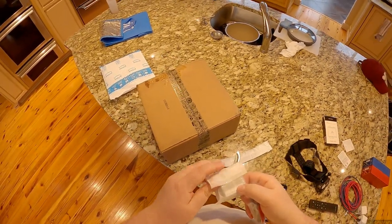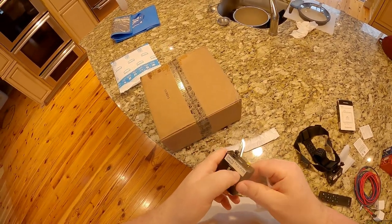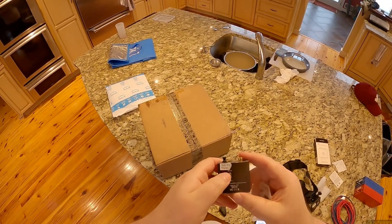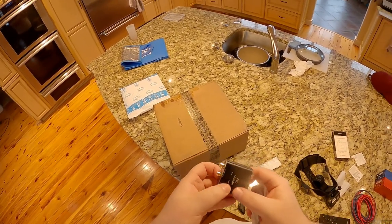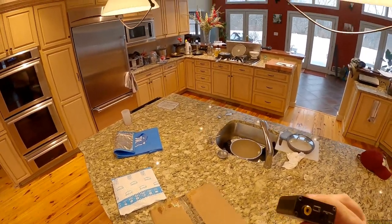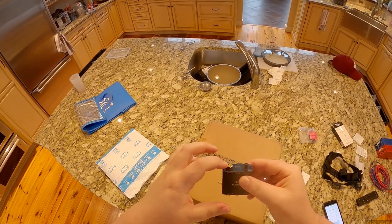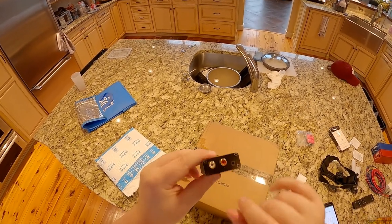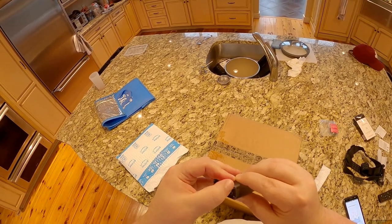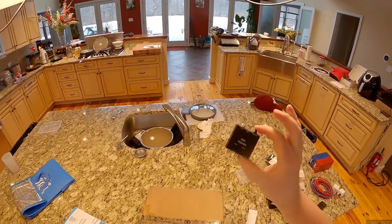This is the FiiO D3 — the cheapest DAC they make, basically. They put a sticker on them because people are dumb. The sticker doesn't peel off properly, you just end up ripping the thing. There's a switch that says optical or coaxial. Your options are optical in or coaxial in, with a power supply of a five-volt USB Mini — not Micro, Mini, the old school big one. You input coaxial or optical and you get RCA out, and also a 3.5mm out. It's actually covered with a protective plate.